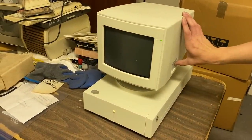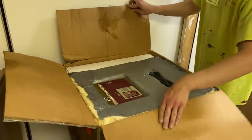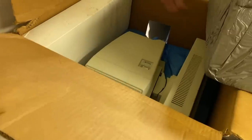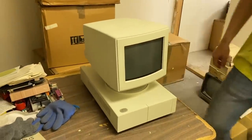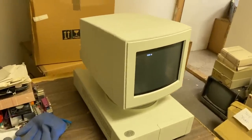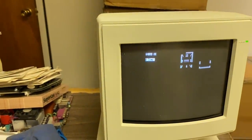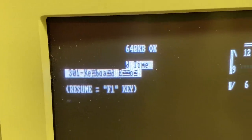On to unit number 4. It appears the roof had leaked during last night's rainstorm and soaked this box. Well, it's dry, so I should probably power it on. The one box that had water damage actually has a system that POSTs. Unfortunately, upon closer inspection the video is garbled — it looks like bad video RAM, but at least this gives me something to go on. This is the most promising unit so far.